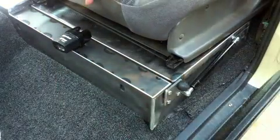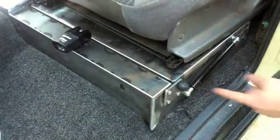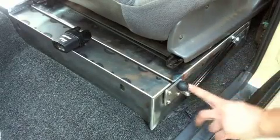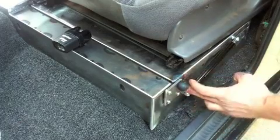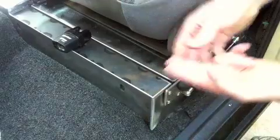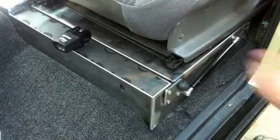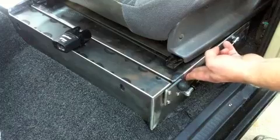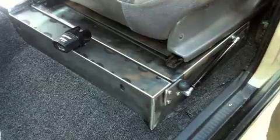Kind of the lighter duty, lower profile option, and when it comes to locking things, low profile is a pretty good option, is to actually just put a lock cylinder right here, just with a small key that would have a hook cam that would swing up and engage in the bottom of the lid. The hook cam would make it so that it wasn't just like a little pawl that would be bent. It would actually have to break the metal to open. But the disadvantage of that is that it's only on one side of the lid, so the other side could flex, but honestly not much.